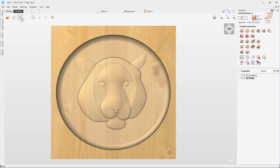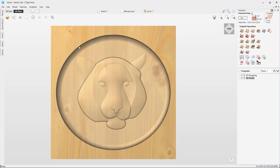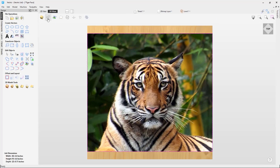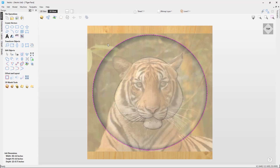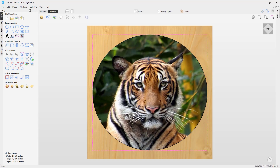Now if we show the picture in the 3D view, you can see that this picture goes over the edge of the dish shape. We will want to trim the image down so the laser picture toolpath only cuts within the shape of the dish. Going back to the design tab and enabling show vectors in the 3D view, we select the vector and the image at the same time and use the crop bitmap image option. This has now cropped the image so it only covers the area where we want to create the toolpath.